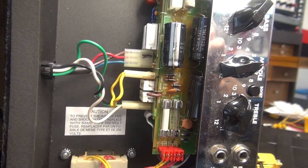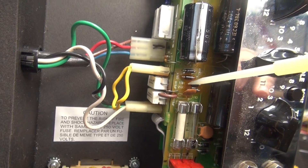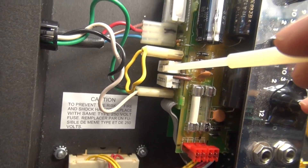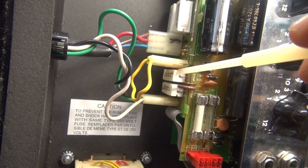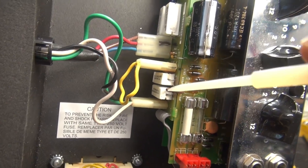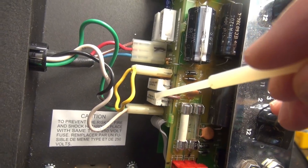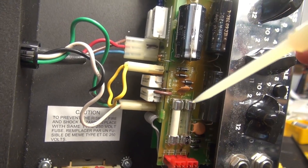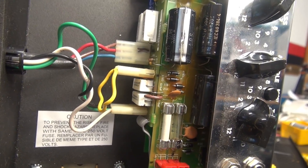So I've opened up the amp and the first thing I spotted — take a look at these diodes here. You can see they've been a little warm; the adhesive is kind of discolored. There's some jumper wires here and those go to these little three-ohm resistors, and those resistors are in series with the filament voltage going to just the 6BQ5s. With all this heating that we see here, and we also have these big wire-wound resistors that are famous for developing bad connections, it's probably right here. So let's flip it on and I'm going to poke around and see if those filaments come on.